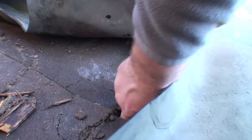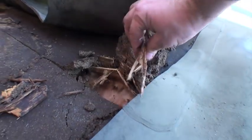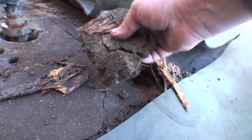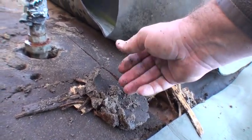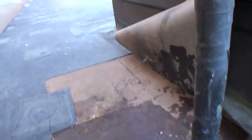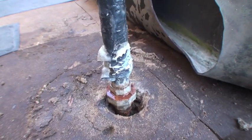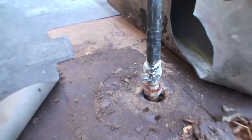There's nothing here. That's what we've got right there. See? We're all the way through. And here is the insulation board that is supposed to, I mean, this is cardboard. As soon as this gets wet, it never dries. As you can see, all the way up to there, that's higher than this. So we know that this is the cause of the problem: when this was installed, nobody put insulation around that pipe. If that pipe had been insulated properly, that condensation would not have come through.